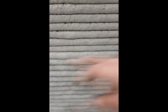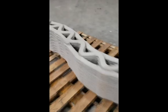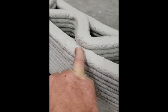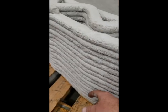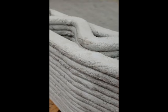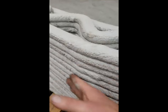You can get a variety of different textures — traditional, rough finish, smooth finish. Something else that can affect the consistency of your wall begins with the drawing. The internal mortar support shown here is designed incorrectly — it's encroaching into your perimeter print. The mud as it comes through has to go somewhere, and even though it's slight, it's going to affect the perimeter wall.